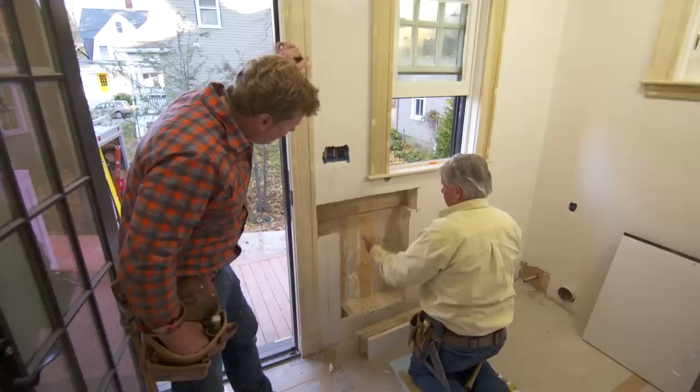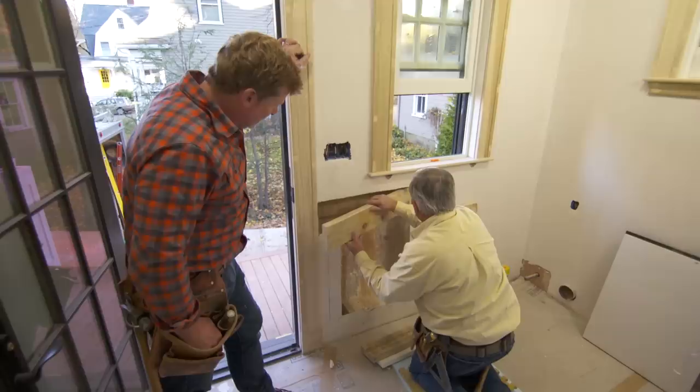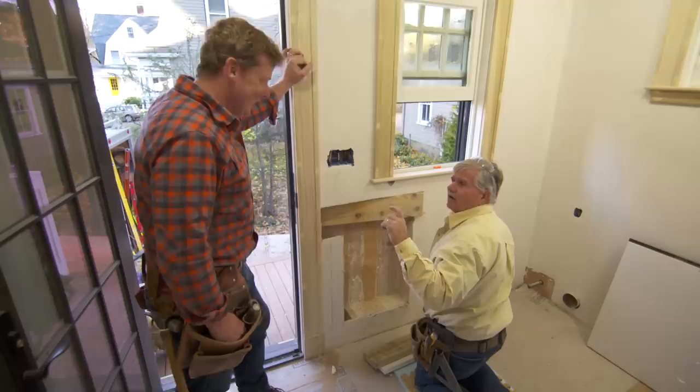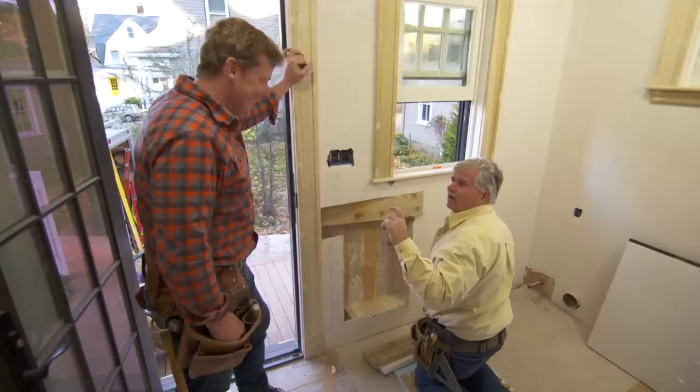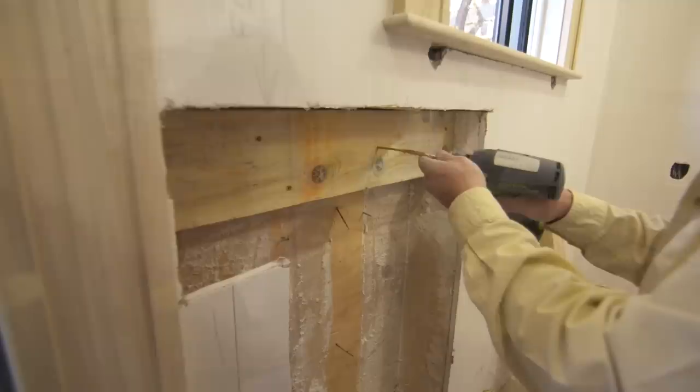So I'm going to build my header in place. I put my first two-by-six in there and I'm going to build it up with three separate pieces and screw it together. How did you size this thing? Have you met Soleil? She's a big dog. I got the height of the dog's shoulder from the dog, and I want to go two and a half to three inches above that. So that's where our rough opening will be. Just get this in and screw it in place. Keep that even on the bottom.